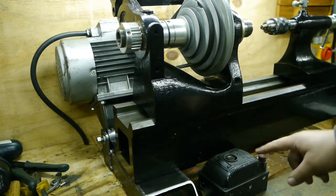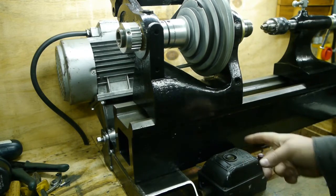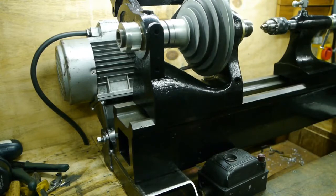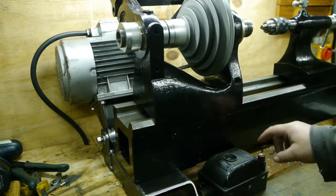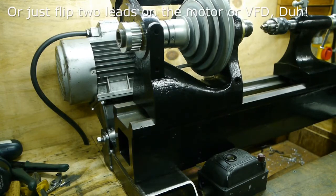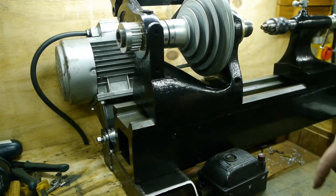The external switch also sets forward/reverse to external, so the machine now runs in reverse but I can't switch to forward using the control on the VFD. I'll probably have to wire in a switch or short out a couple of connectors inside the VFD, because I don't really need reverse on this lathe — you can't run it in reverse anyway because the chuck would spin off.